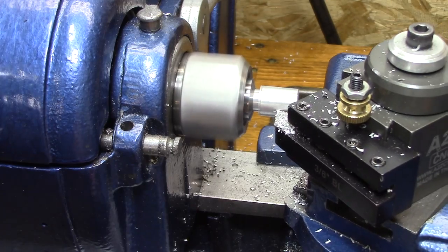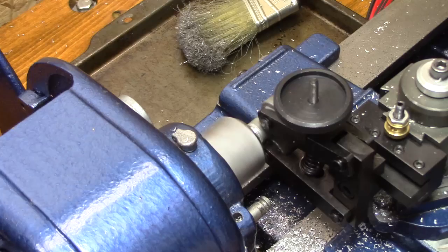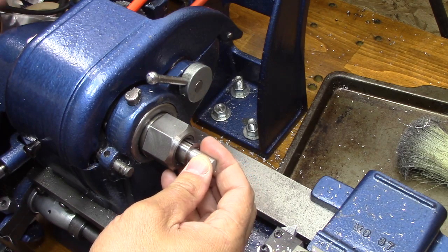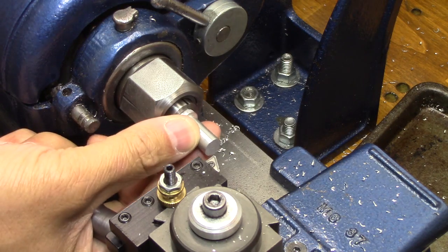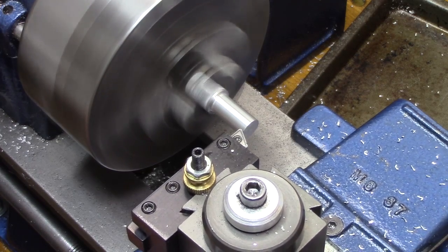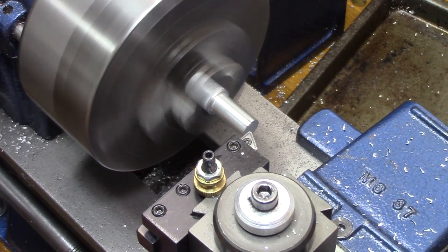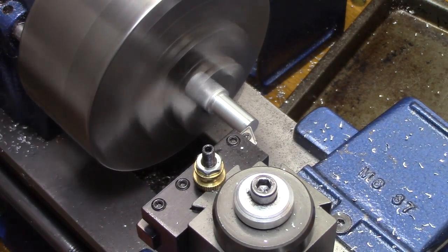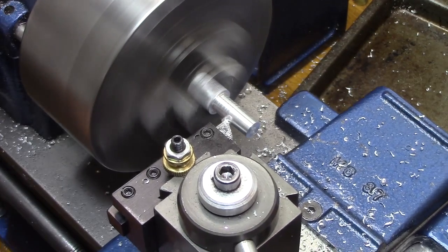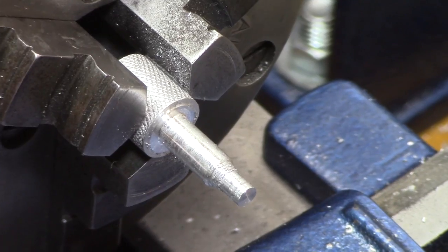There are multiple sessions where I'm down in the basement just playing around with my lathe trying different things. That was the knurling tool, so I decided I was going to knurl something. It doesn't exactly fit in the collet so I stuck it in the three-jaw. I'm going to go ahead and try to thread again. This thing is all chewed up and I can't get that thing to thread with the die.